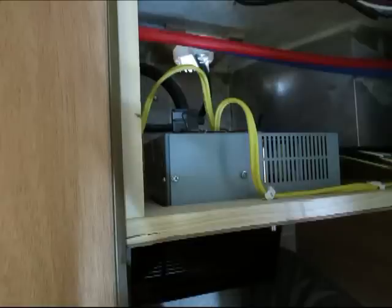These all have to be unhooked and disconnected so that you can get the old one out. The red tubing you see in the middle of the picture is the hot and cold water lines, or blue underneath them. But on the top of the converter is an access plate. You remove that plate and you'll see the wires coming in from outside, and you have your green or copper wires, which are your grounds, and you have your white neutral wires, which they both go to blocks of aluminum